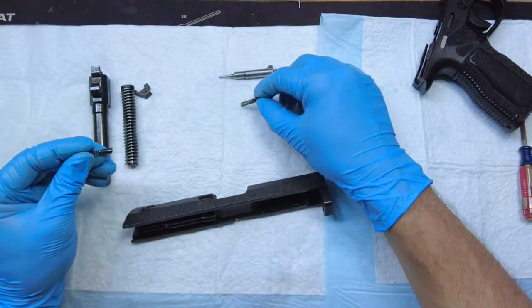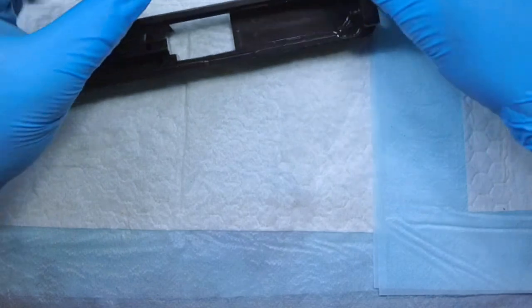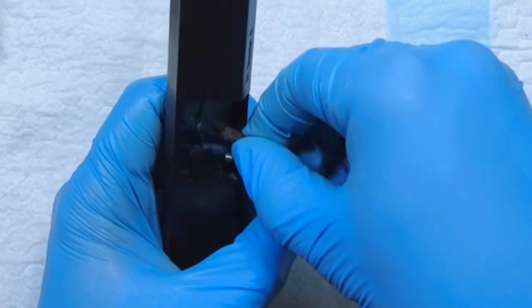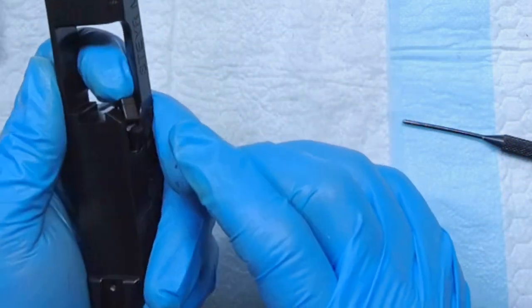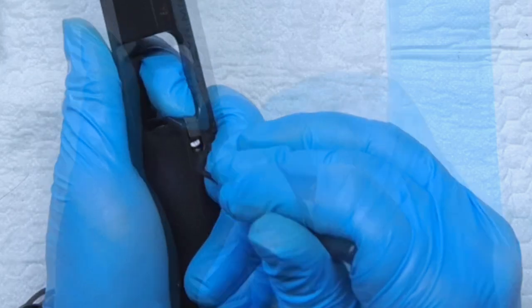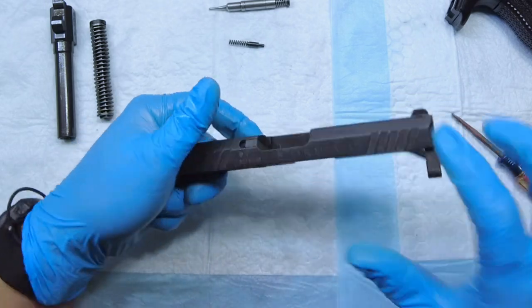Let's put the slide back together. You need to put your ejector back in — make sure you get the piece that looks like this little pin here. When you slide that in, the little angled edge is the one that's going to be pushing in there, so make sure you get that in right. Once you have that spring in, you're ready to put your ejector in — the tooth part needs to go at the bolt face. Use your index finger to hold it in place, slide the spring back, and push the ejector in and it'll lock in place. Make sure you push the ejector all the way down and that pin or detent will keep it in place with pressure.